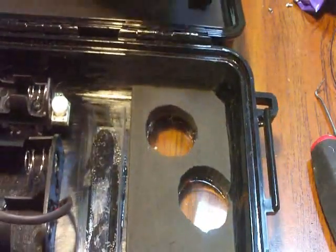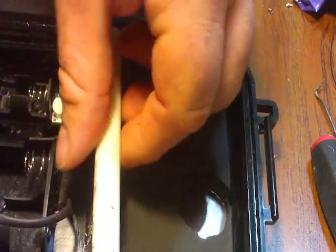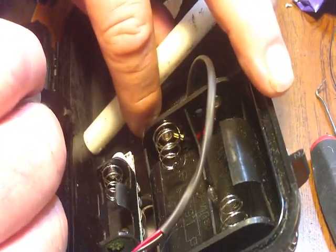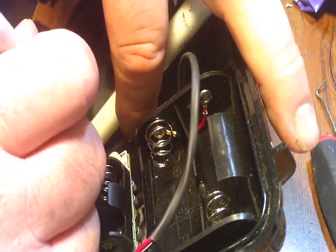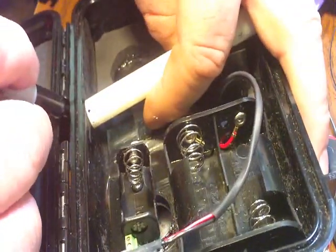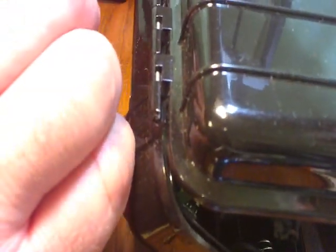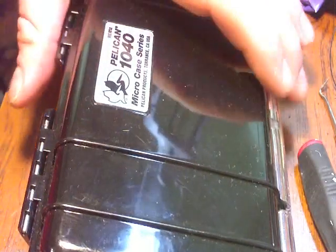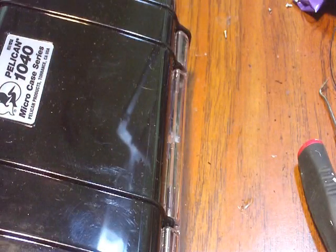I'm going to do my pipe through. I have a piece of plastic tubing and what I do is I'll take this — there's better ways of doing this, I'm sure — and I'll mark the center of my pipe. Then I'll transfer that line all the way down and across, and I'll pick my pipe and go up and make my other line. X marks the spot, and I'll drill my hole there.